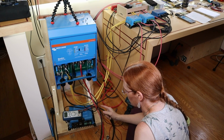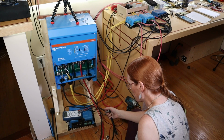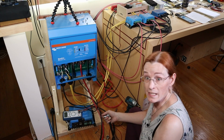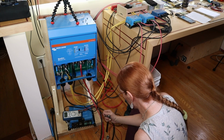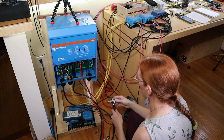Back when I had just one battery, it was really easy to know where to put the pre-charge resistor across the main switch. Now that I've got 6 batteries, I could put it on one and say, okay, always start with this one, but what if that's the battery that fails? So I need to think about where I'm going to put that. That'll all be in the next video because I need some time to think.